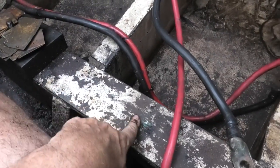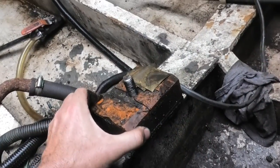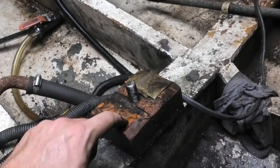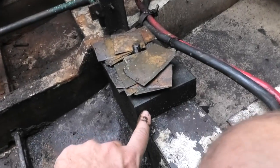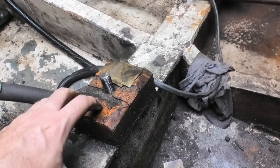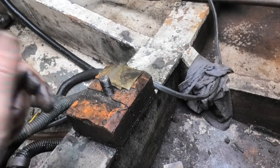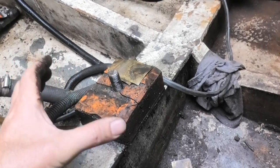On top of that, at a certain point on a railing I'll mount a third float switch that'll act as a bilge alarm. I'm also going to replace these engine mounts — this one's cracked all the way through, this one's just a block of timber, and this one's some sort of synthetic material. Different bolt diameters too. The plan is to upgrade all these to something that's both adjustable and has better vibration absorption properties.